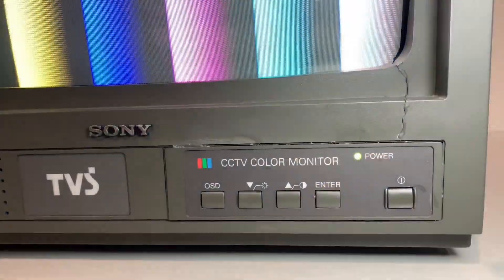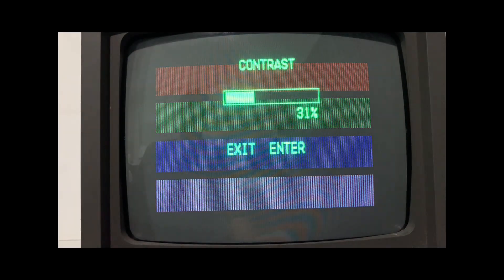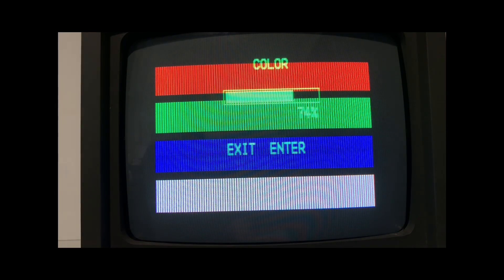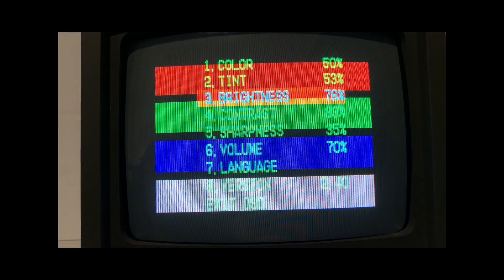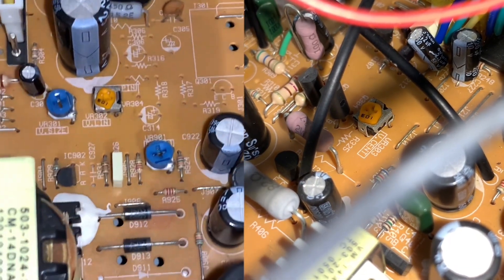The plastic around the buttons got a little toasty and warped from the hot glue. There are two buttons that instantly call out brightness and contrast adjustments; otherwise, just to make a volume adjustment you need to navigate through the basic OSD. Sharpness, colour and tint only apply to composite and S-video. I've got no idea if there's a hidden service menu to adjust more options. When I did tweak the geometry, it was a scavenger hunt to find the potentiometers for horizontal and vertical size and position. But it barely needed any tweaking, and it produces a straight grid and really vibrant colours as you'd expect from a brand new tube.